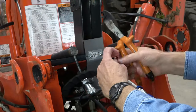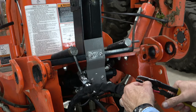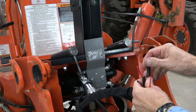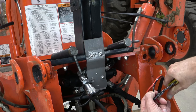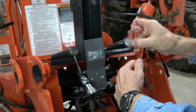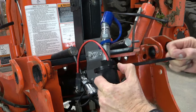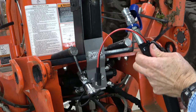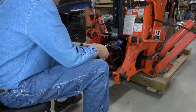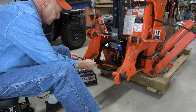Time to splice the standard automotive SAE connector onto the end of the power cable. I cut and stripped the wires, then crimped on barrel connectors, slid on heat shrink tubing, crimped the electrical connector to the power cable, and shrunk the heat shrink tubing with a heat gun. The big zip tie polishes it up. Let's test this wire — nothing sparks yet, that's a good sign.